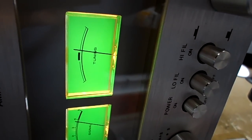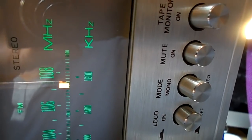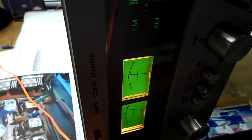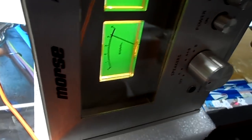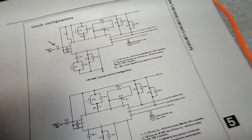My tuning is operating as it should. Mute is operating. Mono/stereo and all that is working — except it's distorted still. The mute's working, but why is it distorted? Very distorted. I have to check the output of this chip — pins 11 and 12 — but both channels are distorted.